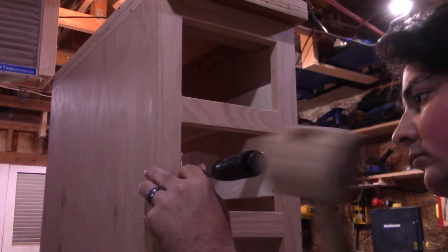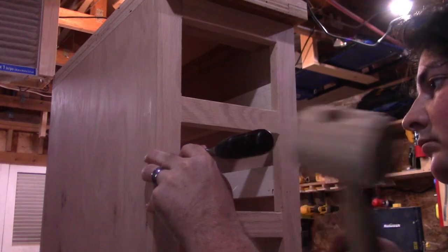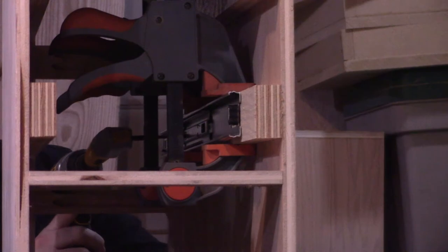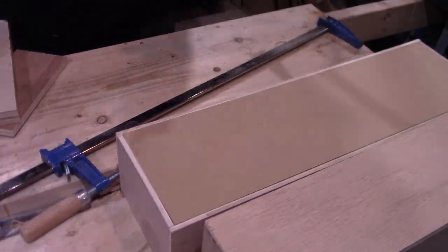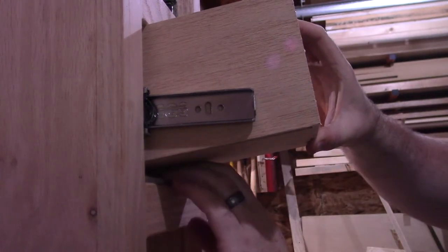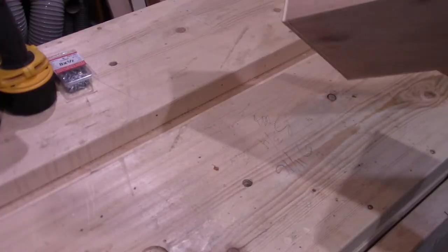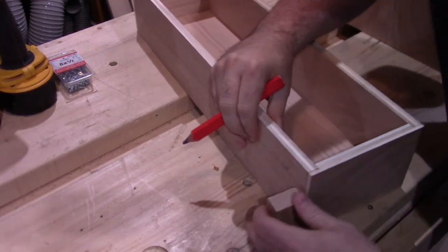These rails got me most of the thickness needed. For the drawer slides to clear the face frames, I still needed to chisel out a little bit more of the face frame. Then using a couple of clamps on the rail to position the drawer slide, I screwed the drawer slides into place. And now with the drawers dry, in theory it's time to install them. I didn't notice my error until right here — these drawers are a half inch too narrow. If this was a project for myself, I probably would have just shimmed the sides out. But since this is a commission project, let's do it properly. Off camera, I rebuilt the drawers to the proper width, and now I just have a couple of random project boxes hanging around the shop.